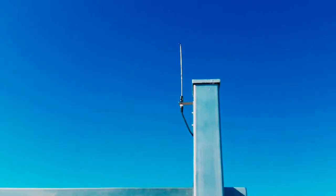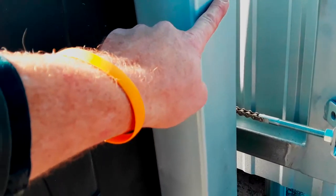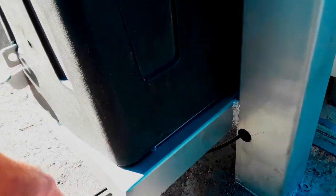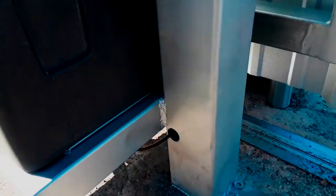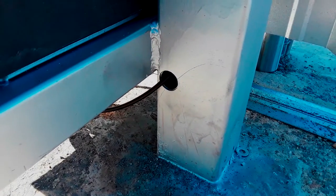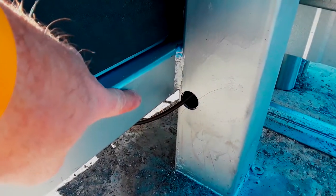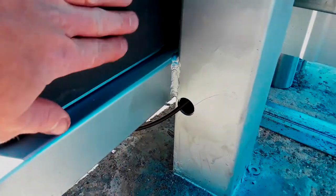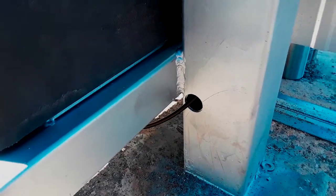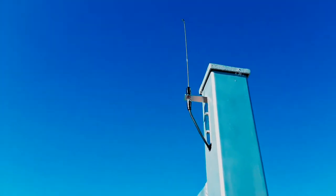The cool thing is that cosmetically, that's all your customer sees. Down here at the bottom when I mount my photo eye, I'll run conduit down to the photo eye and over to here, and it'll cover up this hole. So all you'll see is the conduit for the photo eye and not the antenna. That's the reason for the location — just below where the housing mounts to the gate frame and guide post — because the conduit is going to go right over it, so you really won't even see that hole at all.